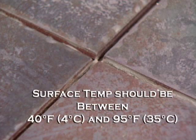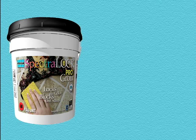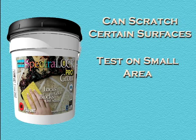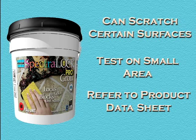The surface temperature range for installation of grout should be above 40 degrees Fahrenheit, 4 degrees centigrade, and less than 95 degrees Fahrenheit, 35 degrees centigrade. It is important to remember that Spectra Lock Pro grout, like other sanded grouts, may scratch glass tiles, soft or polished marble and stone, soft glazed and handmade tiles. You should always test the grout on a small area to avoid damage and ensure compatibility. If you have any questions before you begin, refer to the product data sheet and how-to-install guide for detailed installation instructions.